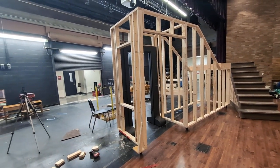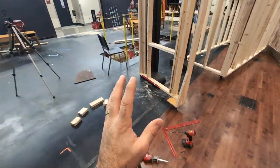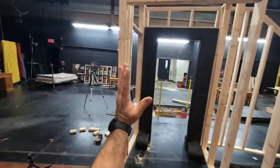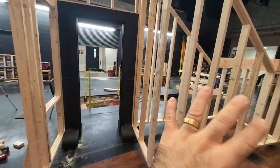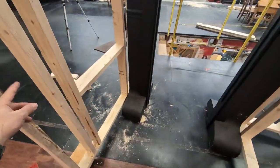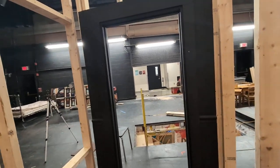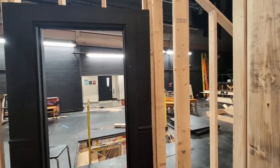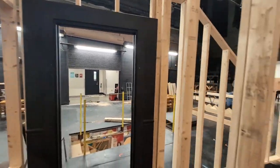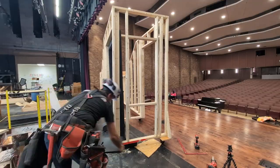Actually, it won't be, we're going to build facade beyond that. So it won't be anything visual, but we'll have that racking controlled, which will help us keep this dangling leg that comes down to the floor and has wheels and goes up and over this, and keep it from twisting around out here or relating weirdness to this thing as we roll around on the floor. That's going to be important. And we can't put plywood on the inside because this was built just line to line big enough to accommodate this rolling doorway. So the plywood that goes on these surfaces will just come up and stop, which will be kind of fiddly to do, but it's just one of those things. We're in it too far now to plan on that plywood thickness. Oh well.